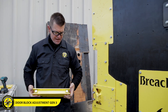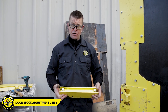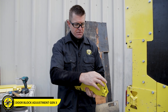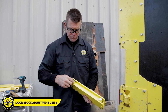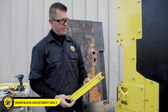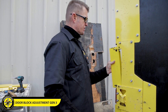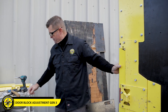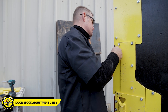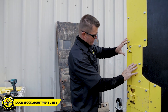What you'll notice in your blocks are two three-quarter-inch diameter bolt heads — those are your adjustment points. To adjust these, go ahead and unscrew them, thinking about how much you want to push out. I saw a pretty big gap, so I'm thinking about the head of the bolt. Then basically just reinsert the block back in place and use a bolt to hang it so you know it's in the right position.